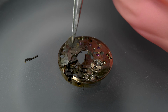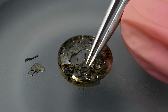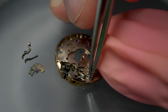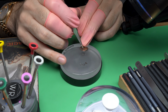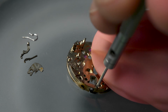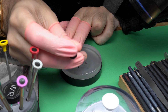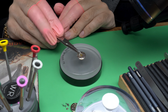Yeah, and you can see it just completely broke that setting lever, but it was going to be unusable anyway. There's the yoke, and it looks pretty unusable as well. Funny enough, that yoke spring, it looks like it held up perfectly fine. I don't know how, but it did. All right, setting lever screw actually still looks like it's okay as well. Yeah, and the setting lever falls out, although it looks, well, at least badly discolored, though it may be structurally okay.